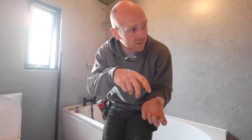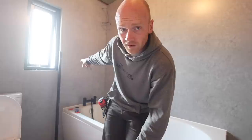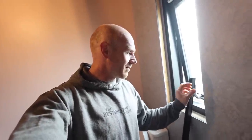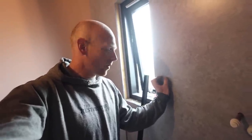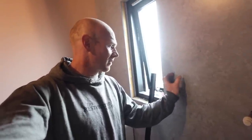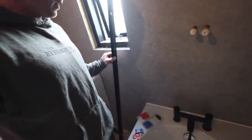I've prepped up our screen and got the pivot section — another channel onto that. Now I've got to fit this one up on the wall. This is where all of our planning should pay off. I know I've got a 50mm batten here on the wall, then there's about a 20mm gap and then another 50mm batten — that was intentional so that the centre rim of our bath, the centre of that, comes up on a batten. Therefore when we install this wall panel we know we're going to hit a strong batten secured to the wall structure.